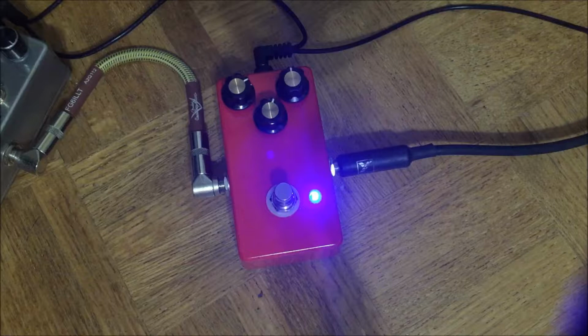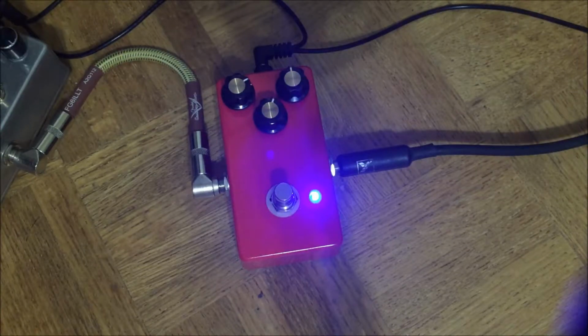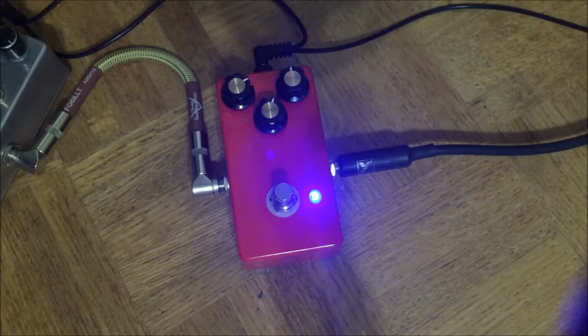So, like I said, I basically took the tone bender circuit and added silicon transistors in the original Bolero. This, I added the third stage. Instead of a normal silicon BJT transistor, I put in a Mosfet device. For those of you who don't know, FETs are field effect transistors. You either get JFETs or MOSFETs. Anyways, they have a tendency to react much more like a tube would in a circuit than other standard BJT transistors would. So it's not exact. I'm not saying that they sound exactly like tubes, but they sound more tubey than other transistors.